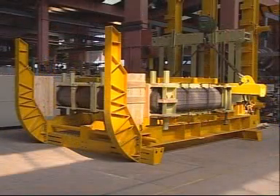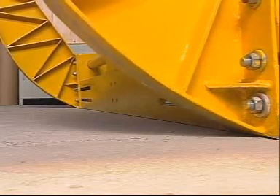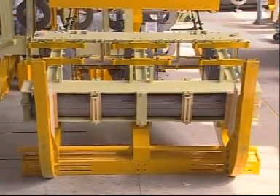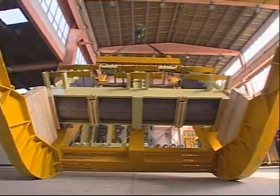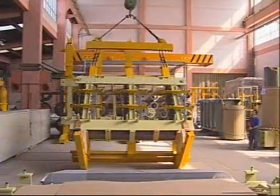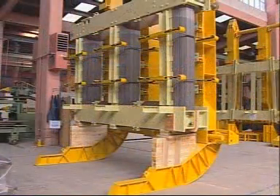The special stacking table is erected with a crane and the core is prepared for assembly. The upper yoke is placed after the coils are fit and compressed with yoke plates. With glass fiber reinforcement bands, homogenous press force is obtained.